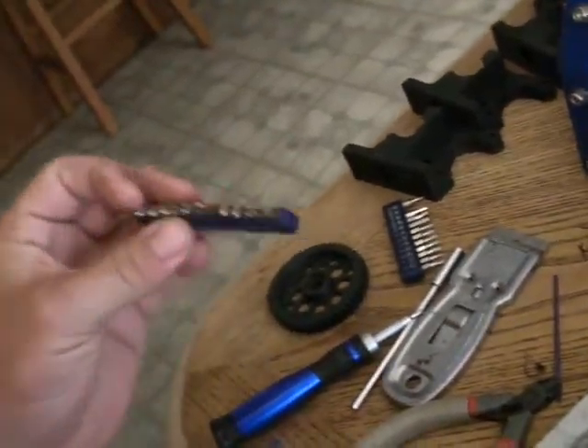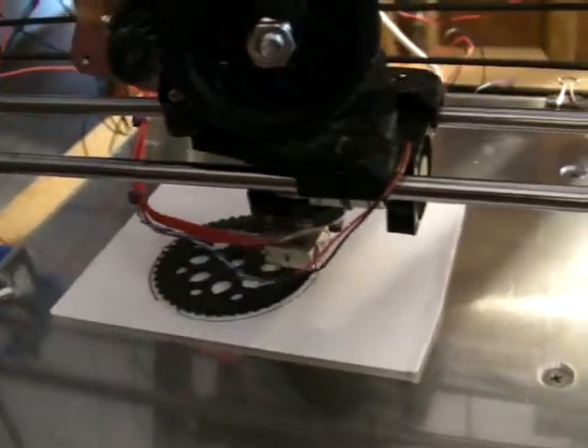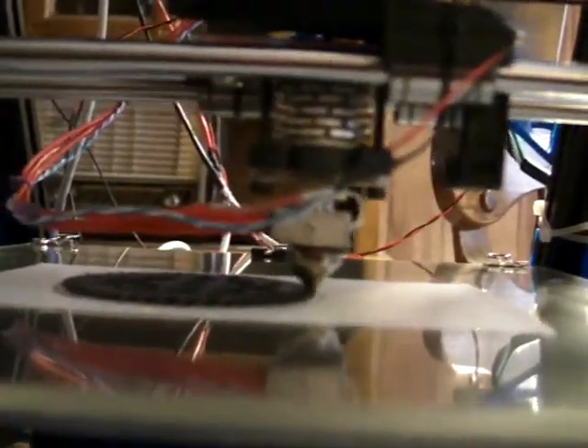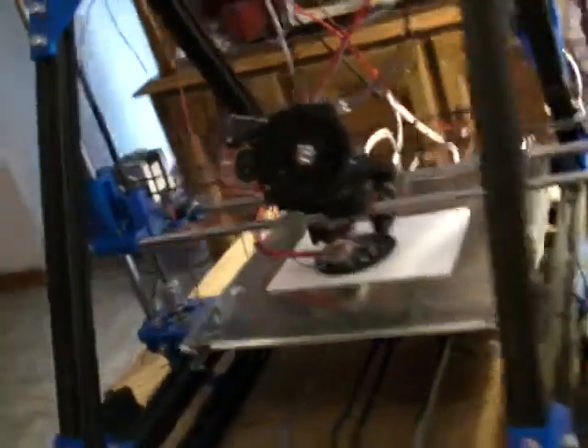Some of the basic tools that I use on a daily basis with the printer: a little cobalt ratcheting screw set with regular Phillips, flat heads, and the Allen wrench sizes that it has are the ones I need to do everything on the printer, which is awesome. Other tools include a scraper if I set the bed too hot, and wire cutters — because when it's printing you do not want to let any free plastic float about, especially when you first start printing, otherwise it will just absolutely screw it up. There's also Teflon tape between the actual hot end and the insulator, which provides additional insulation because you don't want to be heating up the insulator piece through which the filament feeds.